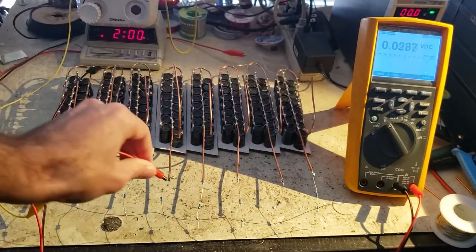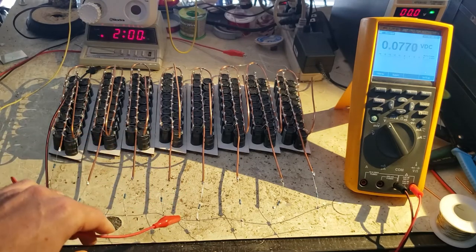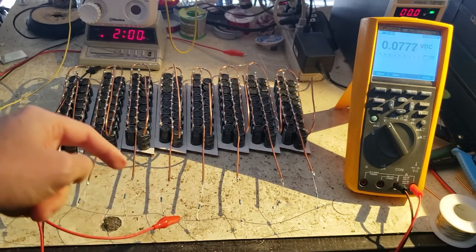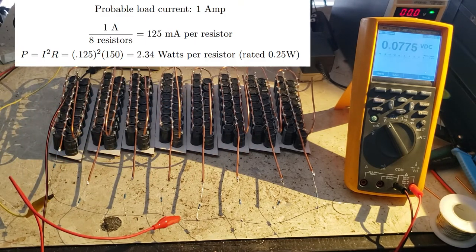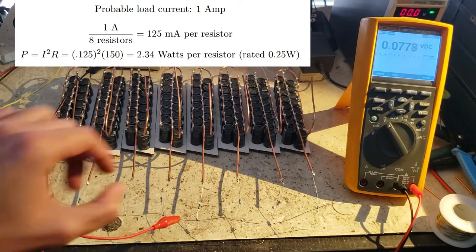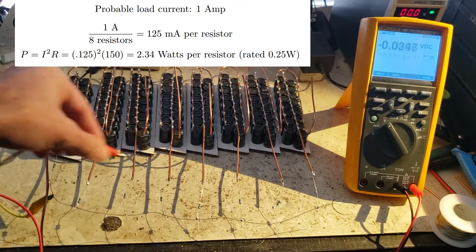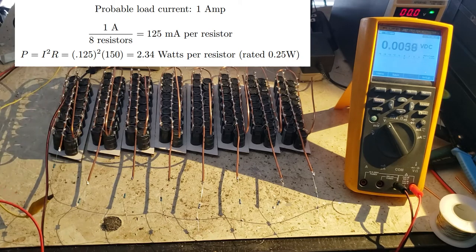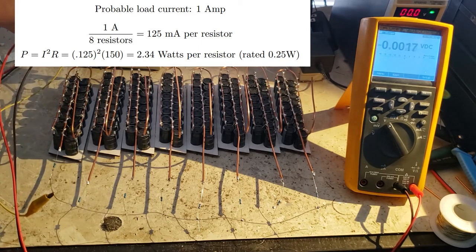And then the bus, after all the resistors, so what I was treating as the general anode of the charging system, is at zero. So it looks like that puff of smoke I got last night was some of these resistors open circuiting in response to the demand. So these little resistors are not overload rated. That's good to know. Not even for a second or two.